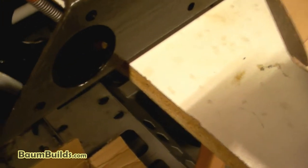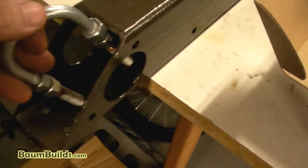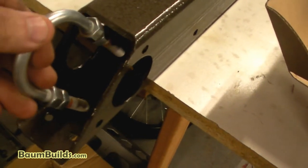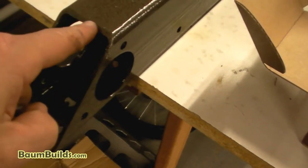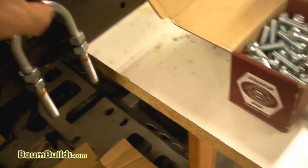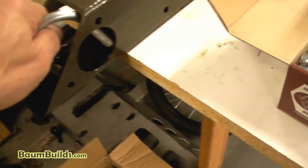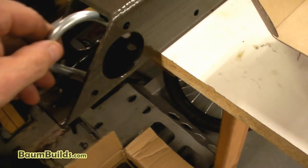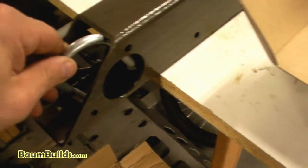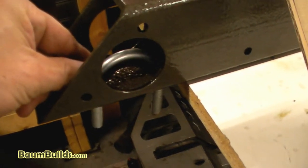As it stands with its length the way it is, you can see I'm not going to be able to get that down in those two holes because of this surface right here. We don't need the extra length on the bottom anyway. So what we're going to do is take and cut that off. Now I've already done that. Here it is after cutting — you can see that we're able to get that U-bolt down through the holes now, and we'll be able to clamp the tube as it goes in across there.